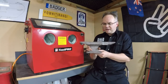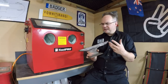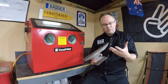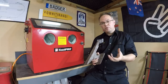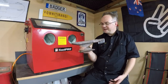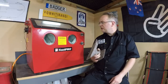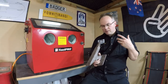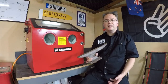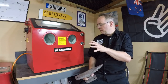Here's the anvil we put in there — it was pretty crusty to begin with. I started off with the glass bead media, which is fairly light, and it was going to take forever. Swapping to the garnet sped things up a whole lot. So be careful with what media you choose for your projects. For a really old rusty anvil, garnet was the one to go for. Glass bead makes less dust and takes off lighter contamination — rust, corrosion, paint — so use the right media for the job.